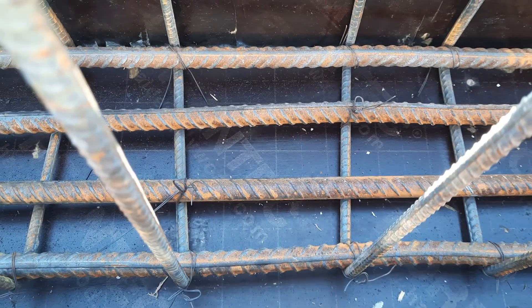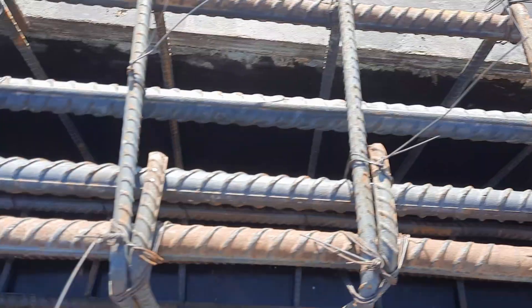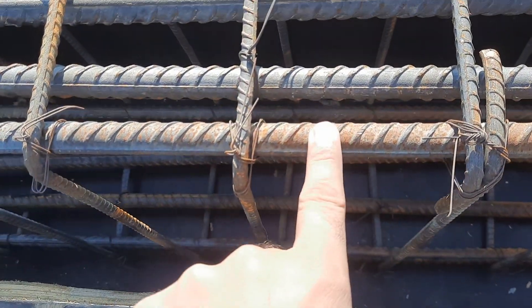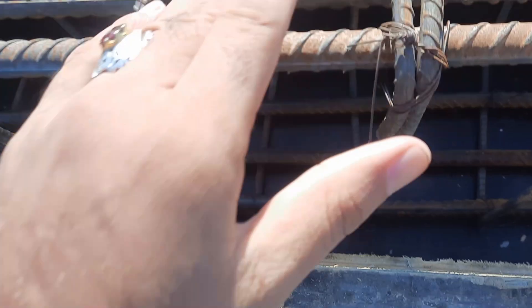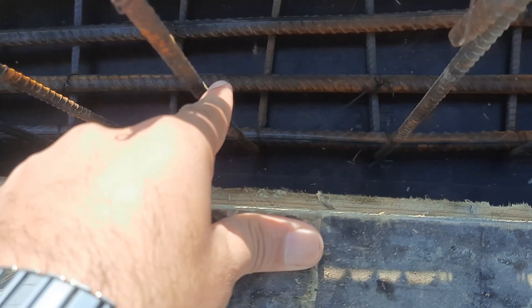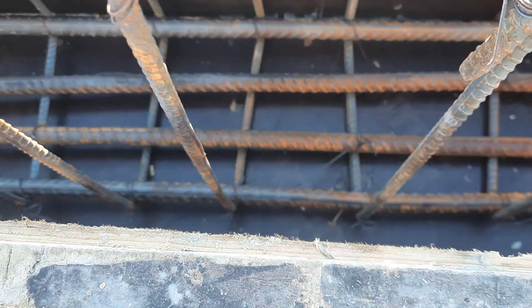After completion of steel reinforcement, at the bottom of these four steel rods they will provide a concrete cover of about 40mm or 1.5 inches to provide proper concrete cover. Looking at the two sections: at the bottom we have four steel rods, and in the upper portion we also have four steel rods — that's because we have two extra middle bars.